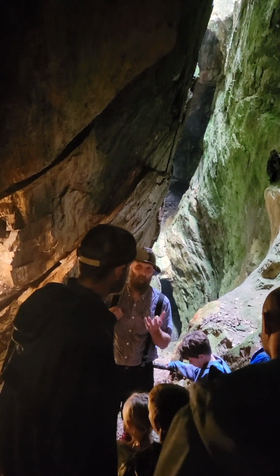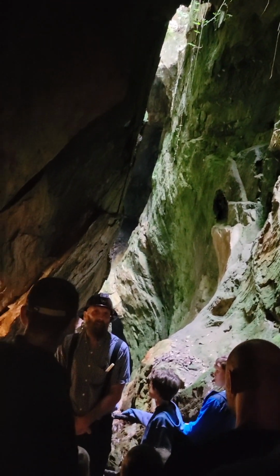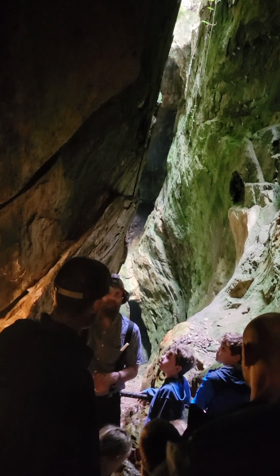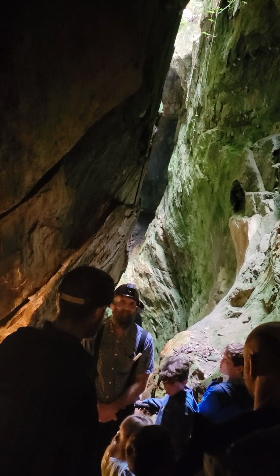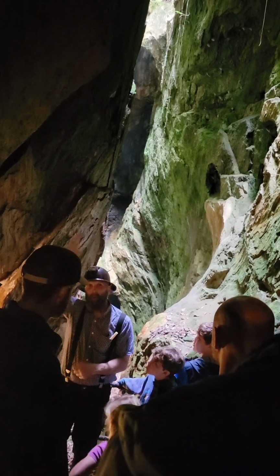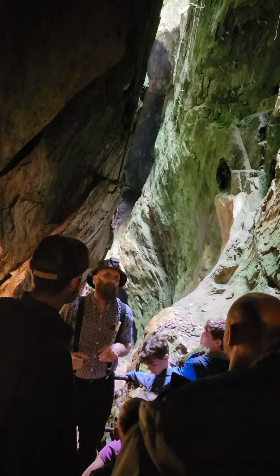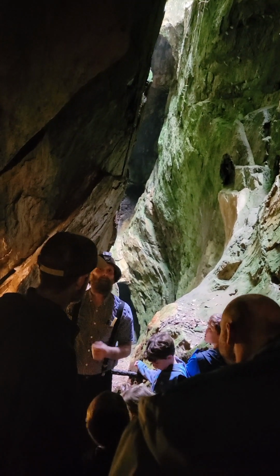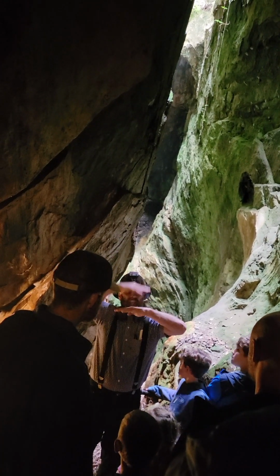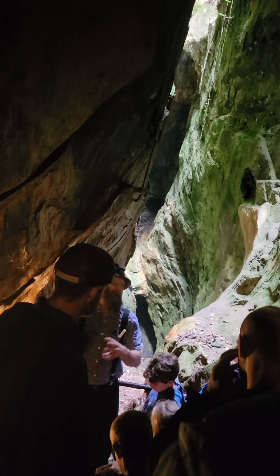All right, hard rock mining. So most of the rock in here is granite, one of the hardest rocks known in the world. Of course, they're hoping to find veins of gold, but primarily they're looking for veins of quartz rock. In the quartz rock, you find tiny little particles of gold about the size of baking flour. They called it flour gold. To get that out of the rock, they take that quartz to the stamp mill. So imagine a big water wheel turning at the river, powering these big piston-like hammers that go up and down. These things weigh 900 pounds each. There's 120 of them in one building. This was a really big operation. They take that rock, crush it up into powder, then they use some chemicals like arsenic and mercury to separate that flour gold from that powder quartz.